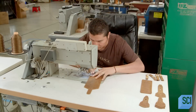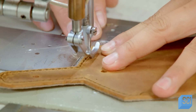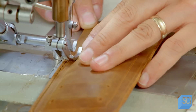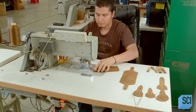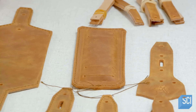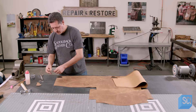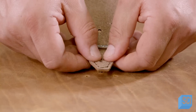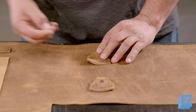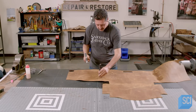A leather worker uses a sewing machine to piece together multiple parts of the leather. The stitching perforations weaken the leather, so for added strength the craftsman uses a heavy-gauge continuous filament polyester thread. Next, a craftsman attaches the buckles. He places one steel rivet in each buckle piece and secures it into place, leaving the remaining rivets out to accommodate the sewing machine, which will reinforce the attachment.